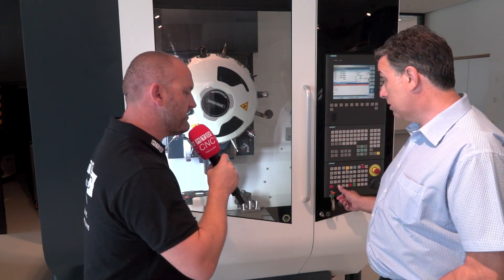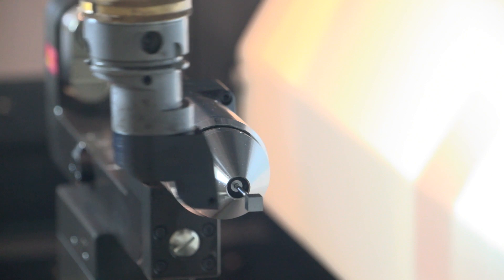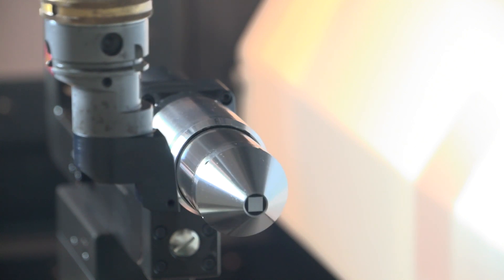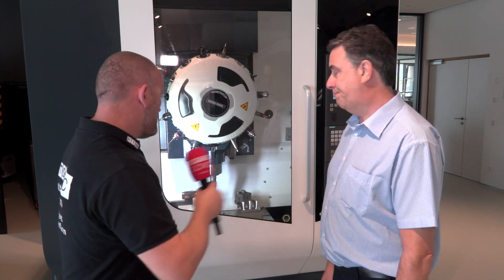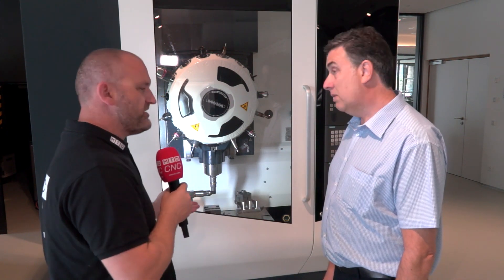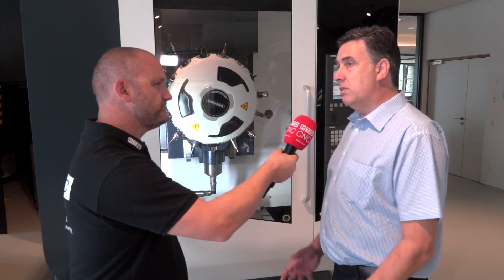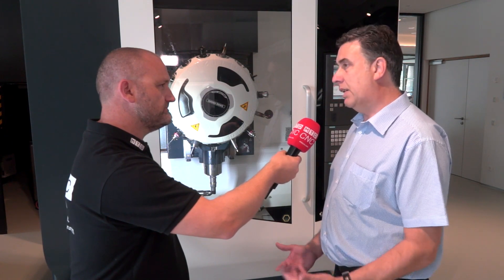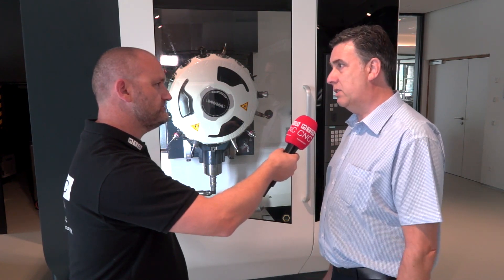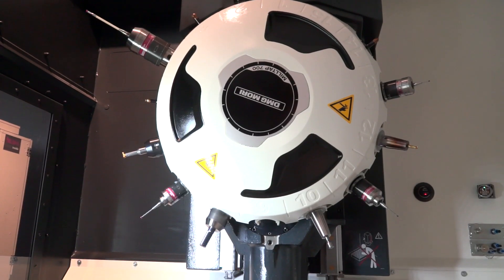Let's give it a go — it doesn't take long. Here we go, and there you see it — a quick measurement, and we've got the data written up to the tool table straight away. That's probably a second, no more. On a laser, it depends on the tool geometry and the machine tool, but you're still looking at least twice as fast doing it with a mechanical system — maybe even more than that.